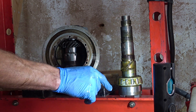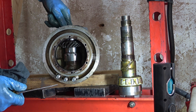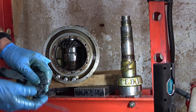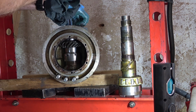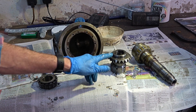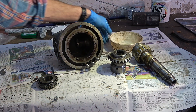The issue has been the top inner — I can see it's seized on here, and therefore there's no means of adjusting the preload. It was set to whatever somebody had once upon a time over-tightened it to. The parts laid out: top bearing, bevel gear, collars and spacer, spindle, bottom bearing, key, casing. Got to be careful with these — behind each of the three Allen grub screws is a bronze pad, and it would be easy to lose those.